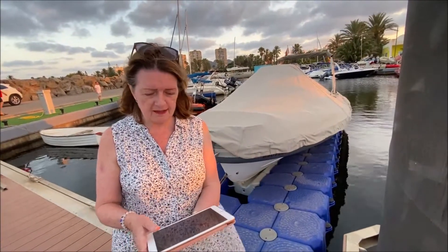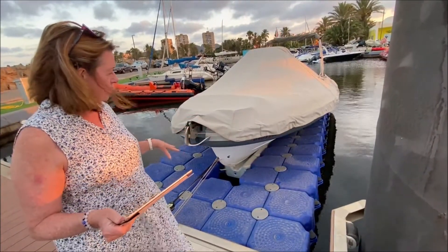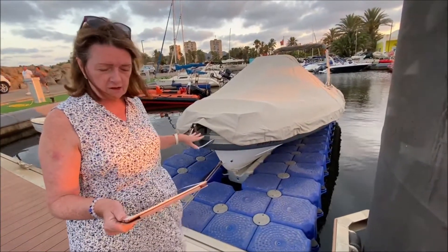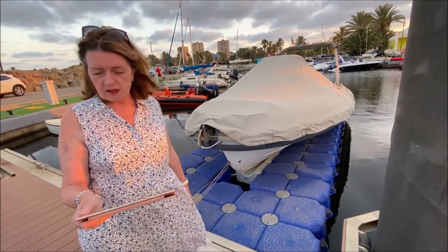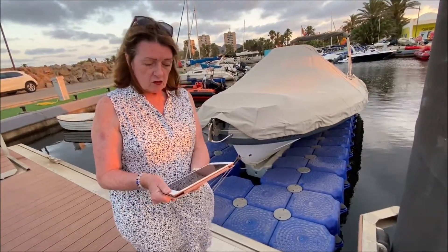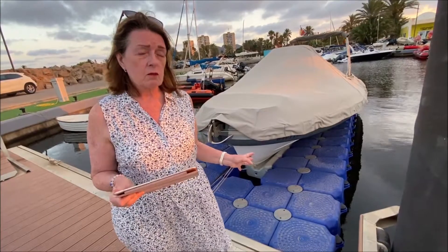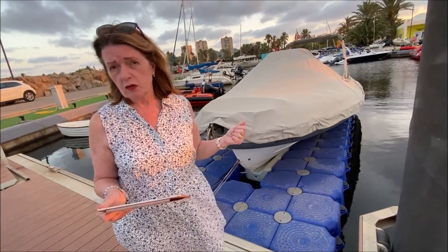Alternatively, you could go with a hard plastic floating dock or platform. As you can see here, it's made of cubes of hard plastic joined together in a pattern with an open area in the middle, where the boat is driven or steered up onto the platform and rests on top. It's an excellent solution but again quite costly, and being bulky it requires special shipment and may depend on your mooring situation. There are also reports that insurance can be affected, since the boat has to come up onto it — so you'd want to check any implications for your hull insurance.